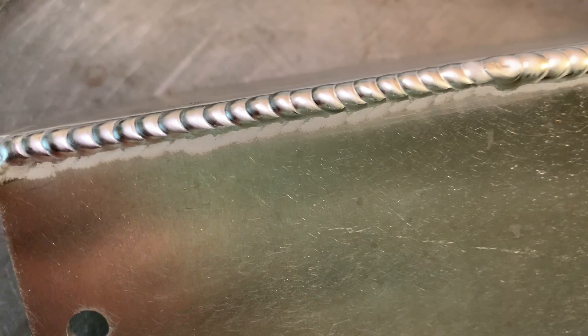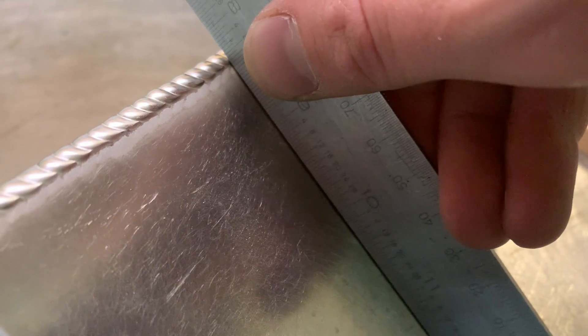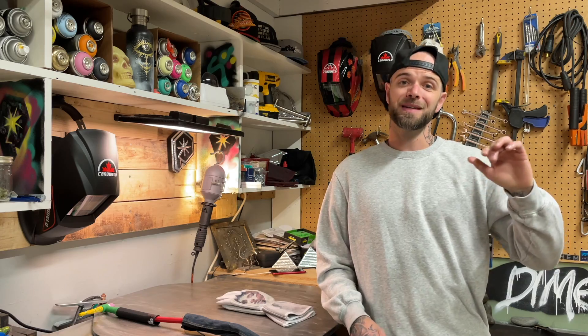Look at this outside corner. You can see there is not enough heat or amperage to fully sit it down and let it fully blend into the base material of the joint. Looking at it after, we might have consistent steps and consistent puddles, but the profile overhangs the plate. You can see with the ruler here, and if you flip it over there's no penetration — the weld did not sit fully down into the weld joint, which means it did not sink through into the base material for proper penetration.